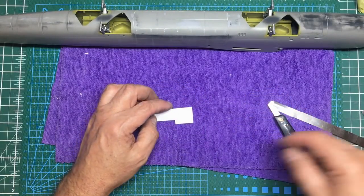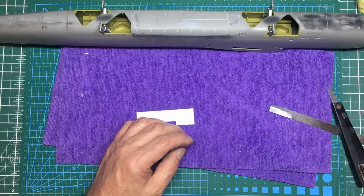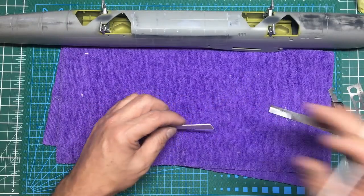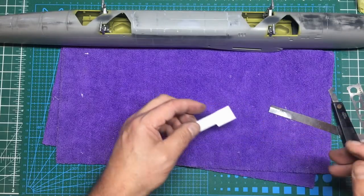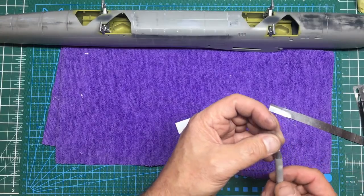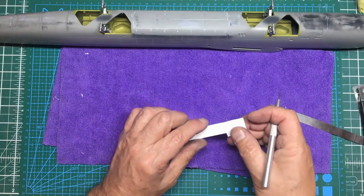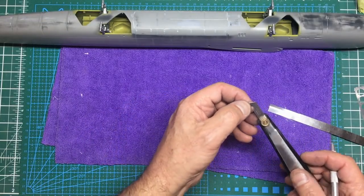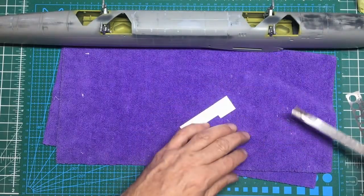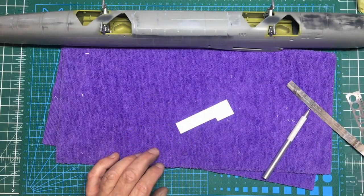So we're going to be using a pin, obviously, to go around corners and stuff, because this won't go around sharp corners. When you're using these templates, I'll talk about templates in a second, you need to use a pin when you're going around tight corners. Now, if you don't have any scribers, you can get a sewing needle or a pin or whatever and scribe away to your heart's content. You just have to sand it off afterwards. But, you know, something to get in your toolbox is some scribers, because they are really, really good. And just get the best you can afford, really. There's lots and lots of different ones about. Let me just show you...